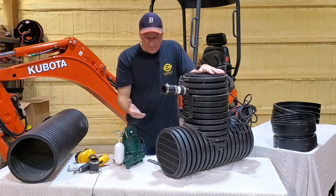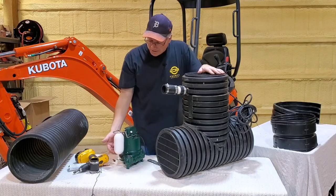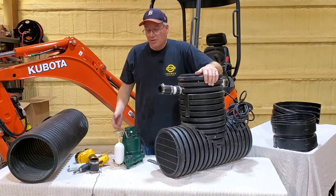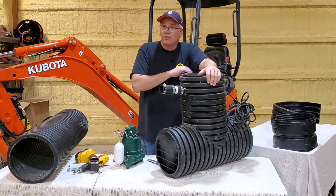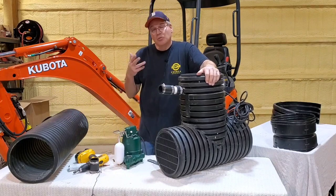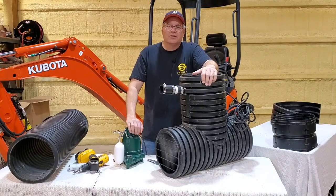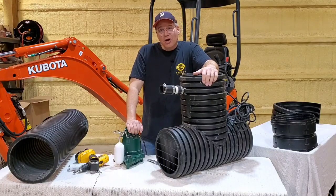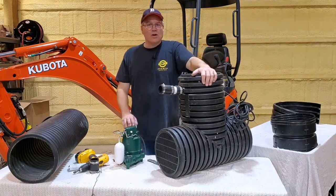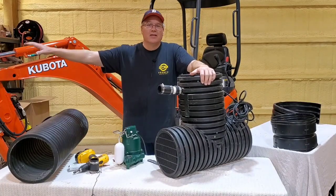All right, so we talked about the water going up and causing the sump pump to run. We don't want it to short cycle like that. When it turns on, we want it to move a crazy amount of water so that for that switch going on, it was worth it. Believe it or not, all the expense of running a sump pump, the electrical costs that you'll see in your electric bill, it's at the startup. The startup is what costs all the money. Once you get this thing fired up, it doesn't cost anything as it free runs.